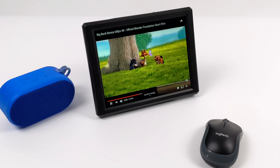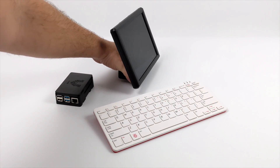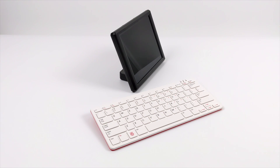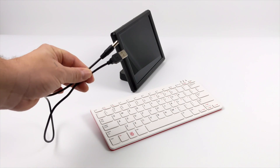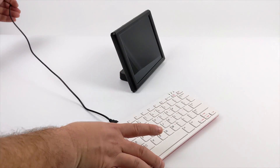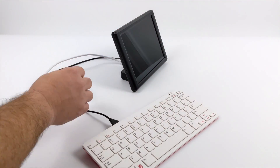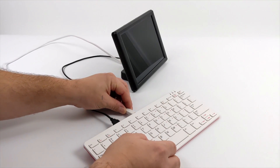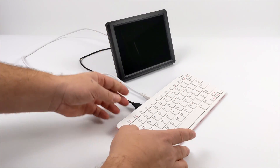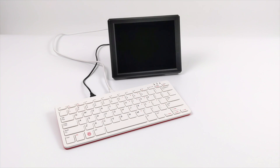Like I said at the beginning, I really wanted to pick this up for the Raspberry Pi 400, so let's move over there. I'm going to hook this up a little differently. The screen comes with that dual power supply — a 5.5mm jack to power the screen and USB Type-C to power the Pi when attached to the back. What I've done instead is picked up a simple USB to 5.5mm barrel jack connector. This screen runs on 5 volts, and we should be able to push enough power from a USB port on the Pi 400 to power the screen. I'll plug one end into the Pi 400 and the other into the screen's power jack, then plug in HDMI. This will take up one USB port, but we still have two USB ports free on the Pi 400 since the keyboard is built in.